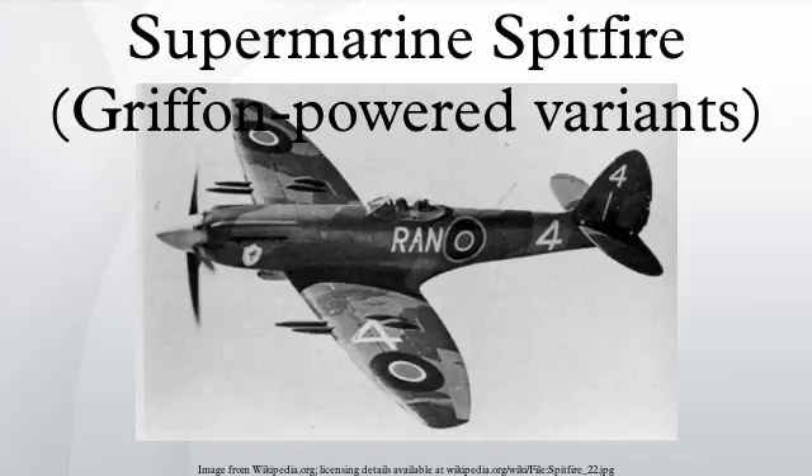The C-Type, also known as the Universal Wing, was standard on the majority of Spitfires built from mid-1942. This wing was structurally modified to reduce labour and manufacturing time, and was designed to allow mixed armament options: A-type, B-type, or four 20mm Hispano cannon. The undercarriage mountings were redesigned and the undercarriage doors were bowed in cross-section, allowing the legs to sit lower in the wells, eliminating the upper wing blisters over the wheel wells and landing gear pivot points. Stronger undercarriage legs were raked two inches forward, making the Spitfire more stable on the ground and reducing the likelihood of the aircraft tipping onto its nose.